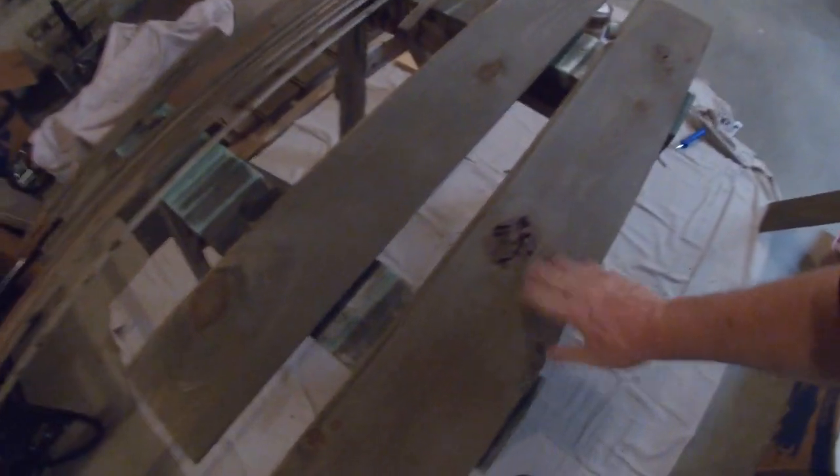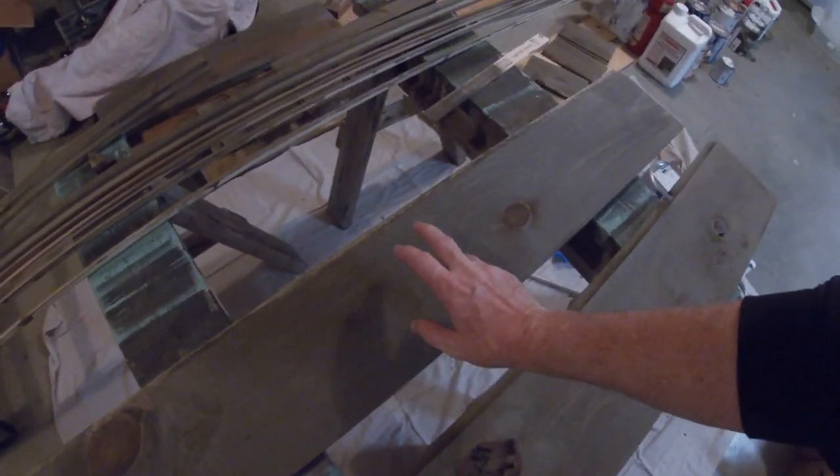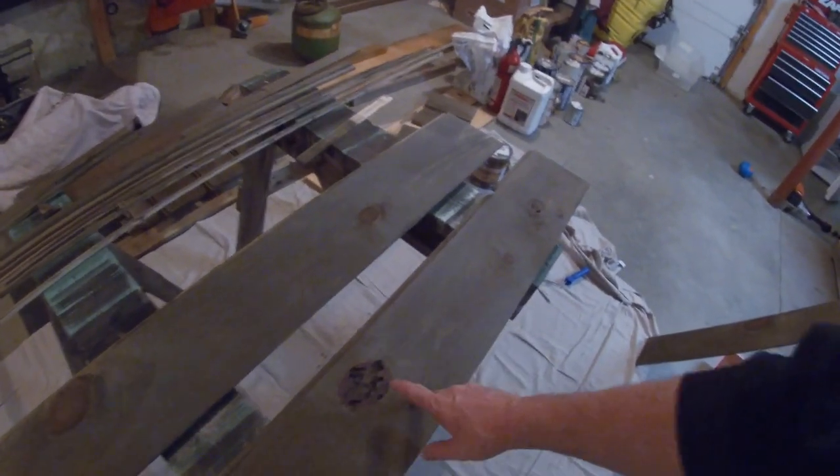I have now finished doing my staining. I ended up doing a second coat. This is a semi-transparent stain called Woodscapes from Sherwin-Williams, and I ended up doing a second coat just to get the tinting level that I wanted. As you can see, all of this is dry and I'm at the tint level I want to match up with what I've got. Now we are ready to get all of this installed.